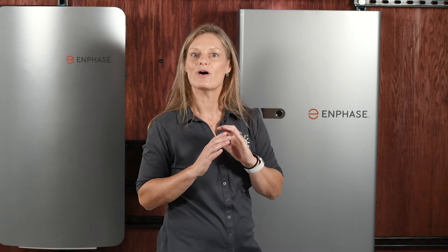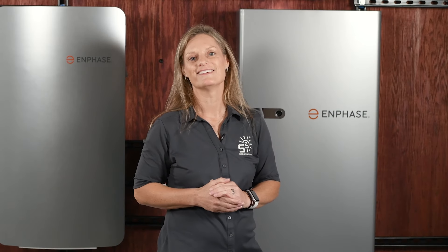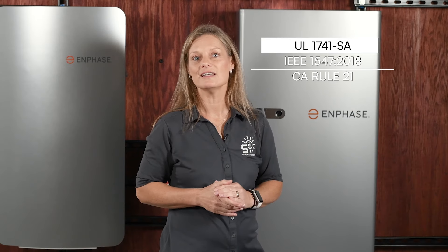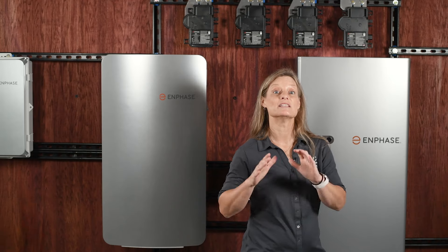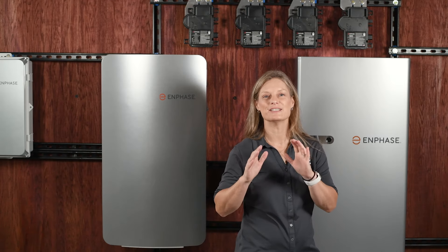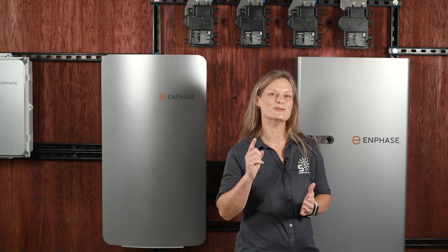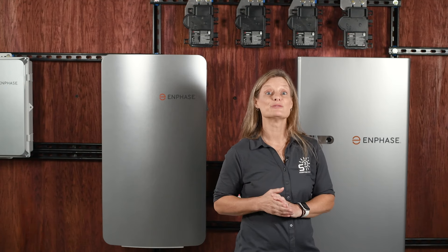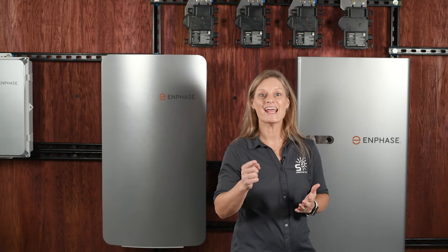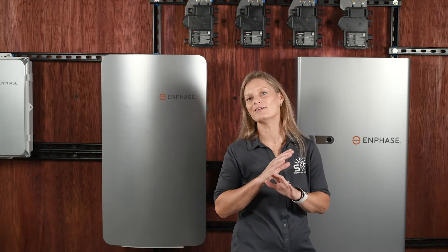When you're dealing with solar energy, safety is just as important as efficiency. The Enphase IQ8 microinverters are packed with safety features, meeting industry standards like UL1741SA, IEEE 1547-2018, and CA Rule 21. The IQ8 series also has built-in rapid shutdown functionality — in case of an emergency, the system can be safely and quickly powered down, protecting both your home and any utility workers or first responders who might need to interact with your solar setup. They also integrate smoothly with other Enphase components like the IQ5P batteries and IQ Gateway, ensuring everything works together seamlessly for enhanced performance, flexibility, and peace of mind.